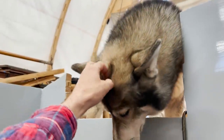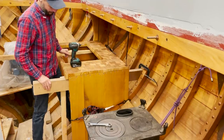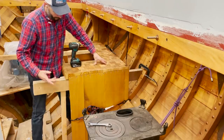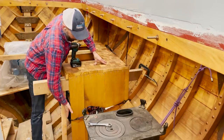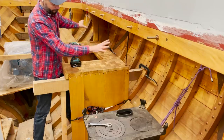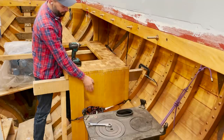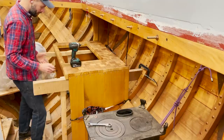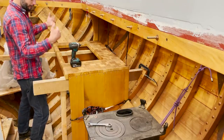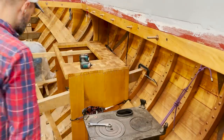So I've got to attach the backsplash piece here, and to do that I have to take these braces out. It's a good sign it's floating. I've got the bolts in here — they're just finger tightened — and then I put a ratchet strap down here and pull the bulkhead back to the build stringers. That should hold all of this stationary until I can get the stuff built in the back, and then I'll be able to put the cleats that join these bulkhead-ish sides down to the build stringers. Eventually a faceplate is going to go in the front here that's going to ride on top of the frames, and that'll really stop this inboard face from wanting to drop. But for now, let's pop these braces out and hopefully this doesn't move.